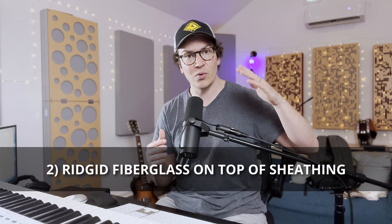The third method to insulate your roof if you have a peaked cathedral ceiling in your studio is to insulate on top of the roof sheathing. This is a green home design that I've seen used, though I don't think it's quite as popular. It may not be as efficient as using the soffit system, but because we are doing a soundproof room, we want to keep that system closed so there are no air gaps leading into your roof attic area.